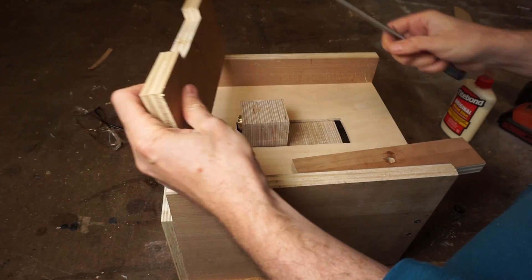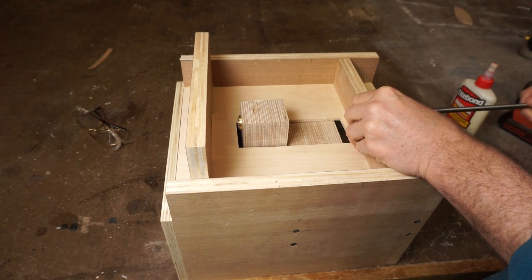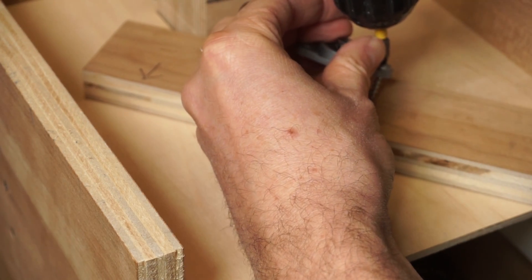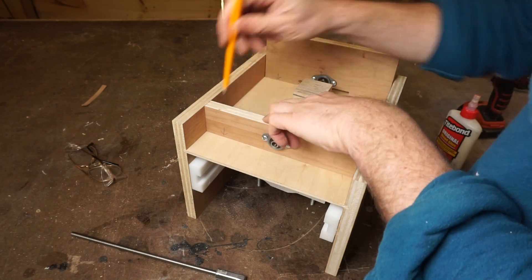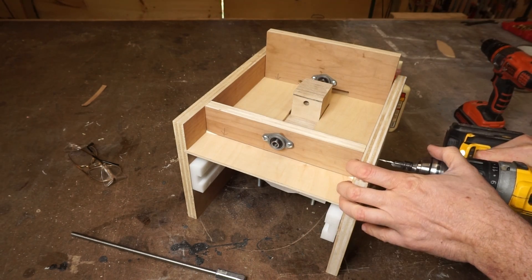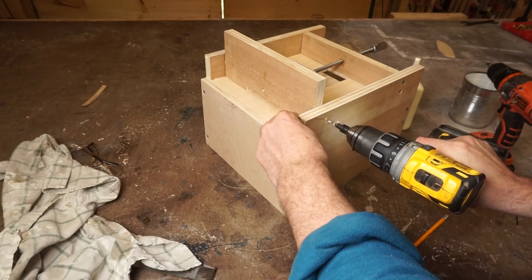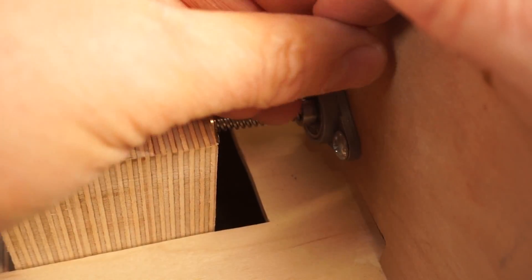Here's our final sandwich — this goes here and this goes here. The bearings go on top in both cases. Each of those bearings is held onto the ledges with some small screws. Then those two ledges with the bearings screwed in can be glued onto the housing. I'm marking off where the glue is going to go and applying a little glue — and I'll do the same on the other side. I put glue all the way across and there's a little gap there, but that's okay, just wipe it off. The lead screw is held into the bearings with these little set screws that I'll tighten in place.